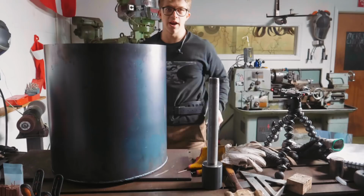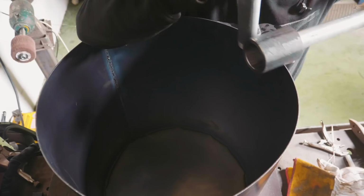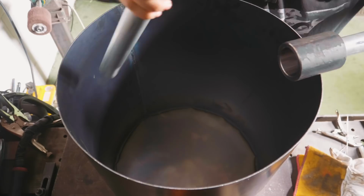Now, interesting here is we're gonna have a cylinder. These burners need to not be in the middle pointing flame straight at the crucible, but they wanna be on the edge so it creates, to a certain extent, a spiraling flame or a vortex of a flame that goes around the outside of the crucible, helping get a nice and even temperature.